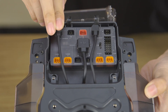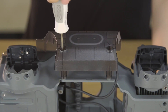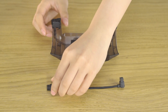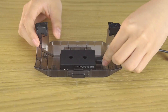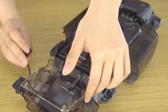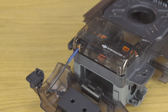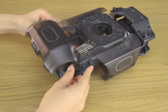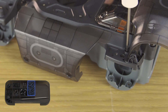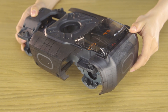Connect the black cable to the black port. Connect the cable straight end to the chassis rear armor's hit detector. Fix the cable with the armor's cable holder. Hold the cable through the chassis rear cover's cable slot and connect it to the motion controller. Secure the screws. Check whether the rear armor can be fastened.